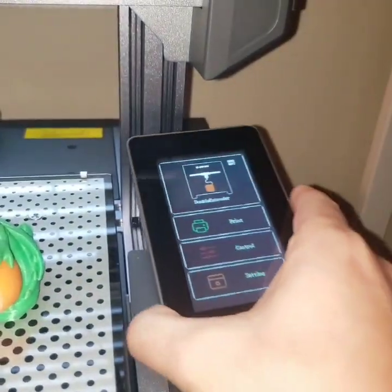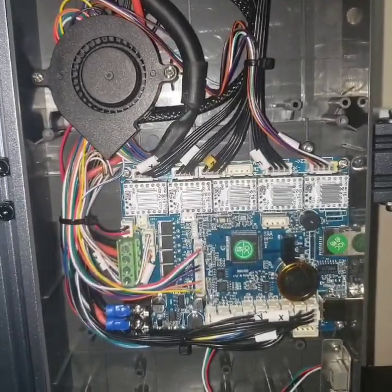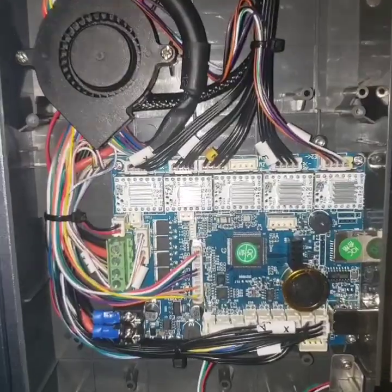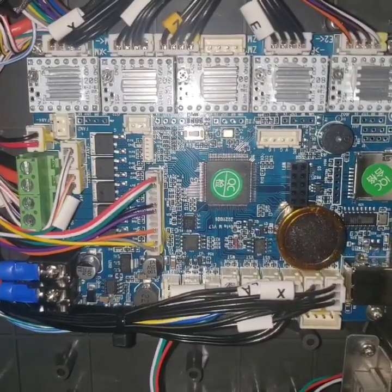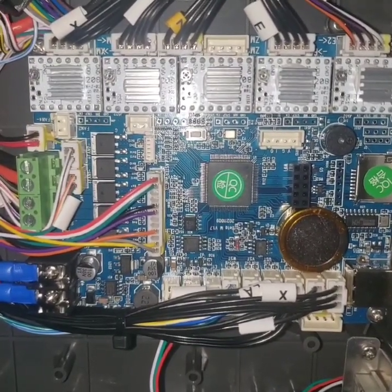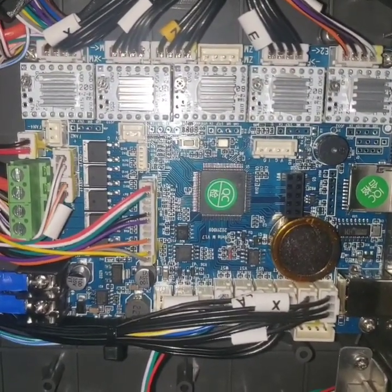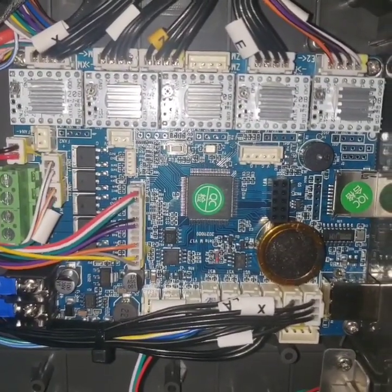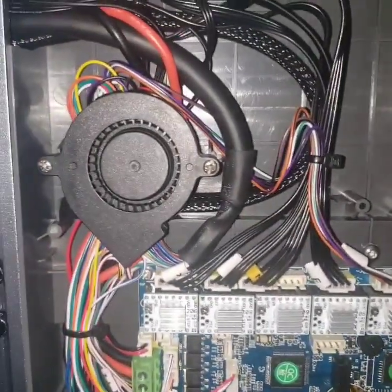The screen is removable and has a very long cord. Here's the board for the V3 — it's a standard STM32F407 but it is a proprietary design. It has TMC 2208 drivers on it. One of the bad things about it being proprietary is it's all closed. They won't share their pin outs, they won't tell you anything about the board. You can see what it is based on the chip, but you can't get Marlin compiled for it. You can't get Klipper compiled for it either.